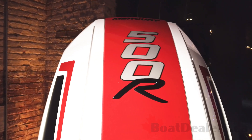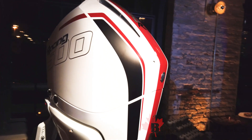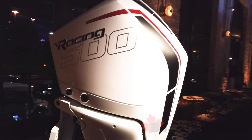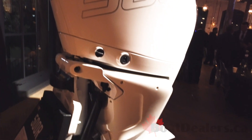Let's start with the powerhead here. It's a 4.6L V8 Supercharged outboard powerhead, just like the 450, but the internals are enhanced for more durability. There's a stronger crankshaft with a one-inch spline, new crank bearings, enhanced pistons, rods, and rod bearings.